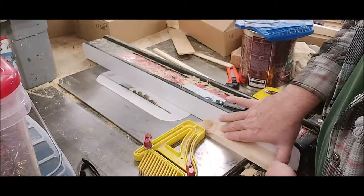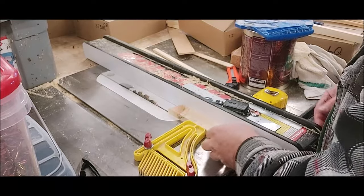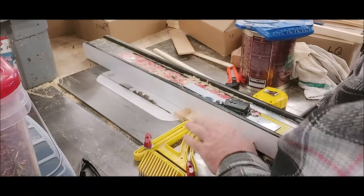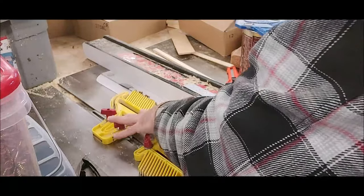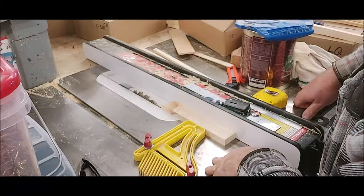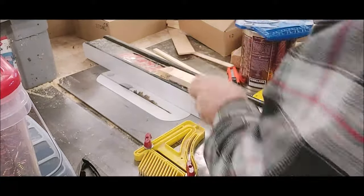That's the difficulty in cutting thin strips. Every time I make a cut I need to move my rip fence — it's mostly a measuring block rather than a fence that keeps things pushed in. I can't use a second feather board because that would trap the thin strip between the blade and the feather board, and sometimes it can come back at you.